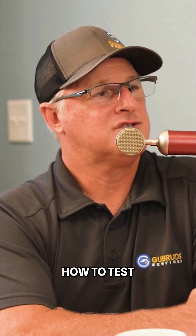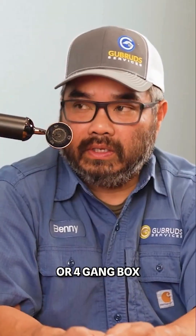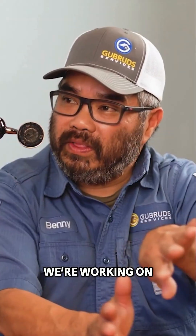If you're a qualified electrician, you understand how to test and you know what you're looking for — it's not an issue. I always check: if I shut down that circuit and it's a three-gang or four-gang box, I go in there and find that one side is still hot. Well, let's not touch that side — we're working on this side only.